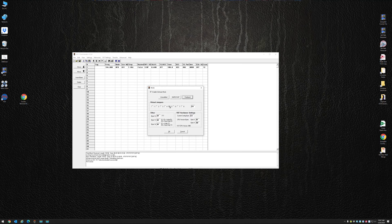You can manually go in and remove both checkboxes. It's set up for O2 here, which is Wide Receive, and Wide Transmit — byte 14 is 01. What I want to do is write this back to the radio, because my goal is that once the radio is software modded, I could then use RT Systems to program the radio, and I want to see if the software mod retains once I start programming it with RT Systems.